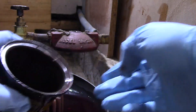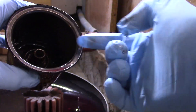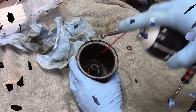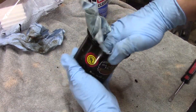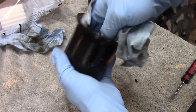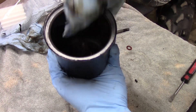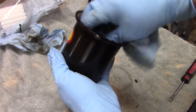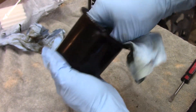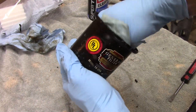I'm going to clean this out real well. You can use carburetor cleaner or brake cleaner — something that basically doesn't leave a residue and evaporates really quickly. The filter is your first line of defense in keeping your boiler or furnace running properly. It filters out contaminants and sludge, which is important because you have a really fine nozzle in there. There is also a pump screen which we'll be cleaning or replacing shortly.